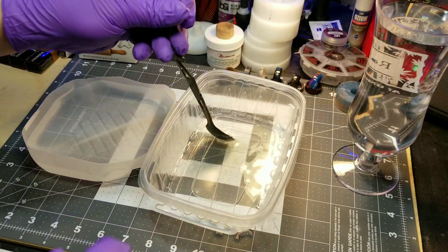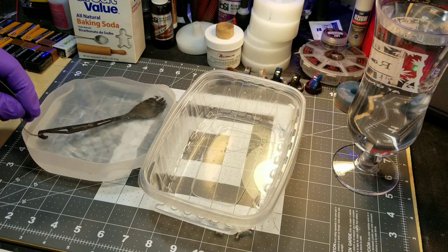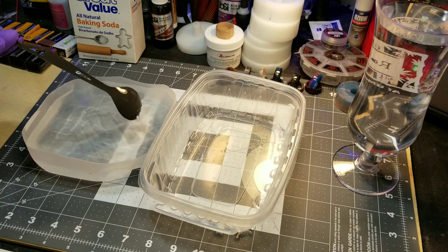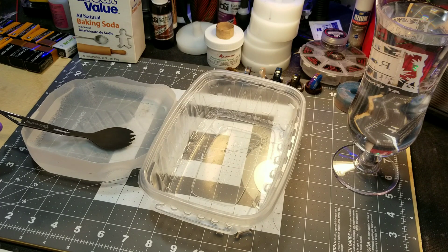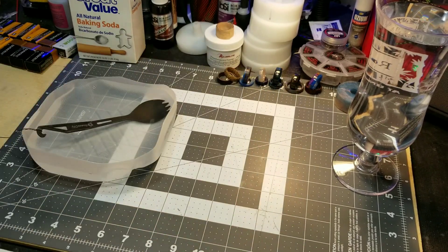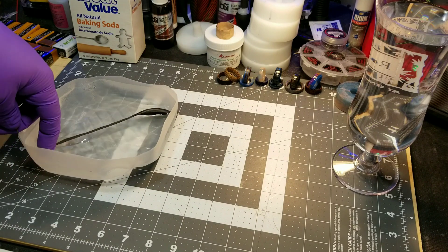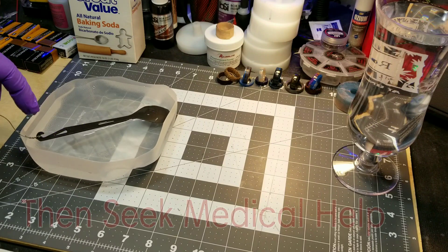As soon as we're done etching, go right into the distilled water. Our piece is now etched and ready to be anodized — I'm going to leave it in the distilled water until we're set up and ready to go. Move the Wink out of the way — this stuff is pretty nasty. You're going to want to make sure you're wearing gloves while using it. You don't want to get any on you, and keep baking soda on hand in case you do, so you can neutralize the burn.